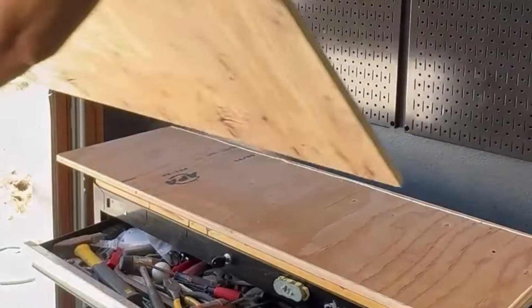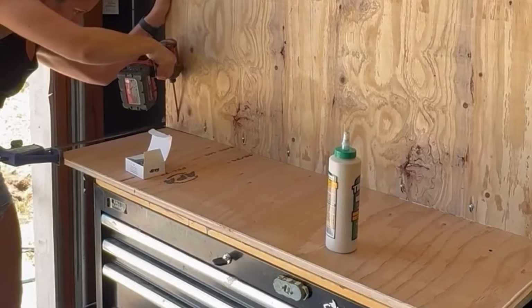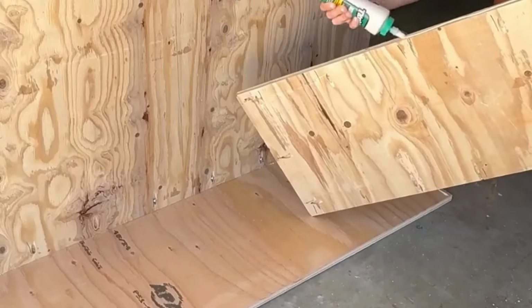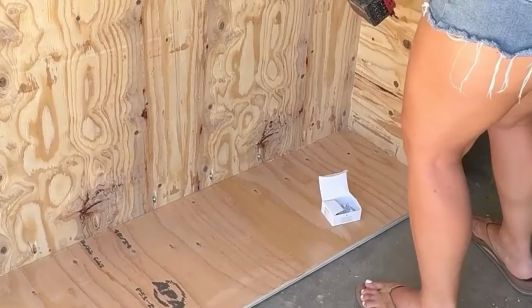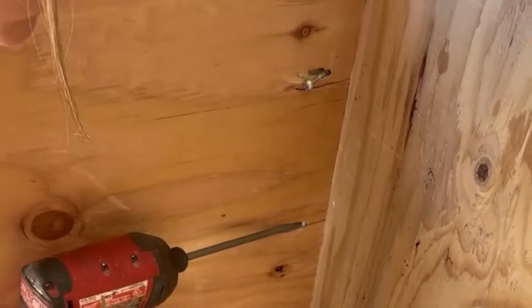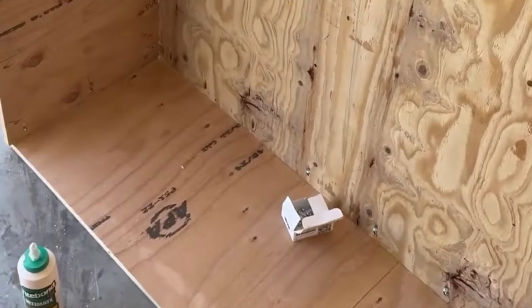So I started assembling all the pieces using wood glue and pocket holes and secured this front piece onto the base, and then took 2 pieces of 3/4 inch plywood and secured them to the sides. So basically I have the base, 2 side panels in front, and this is 1/2 of the bar. And essentially it's a really unfinished cabinet box.